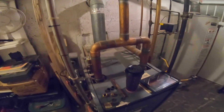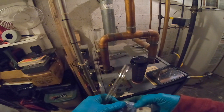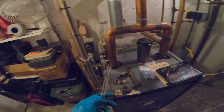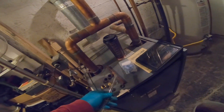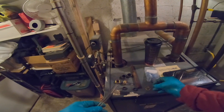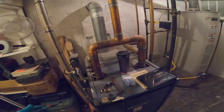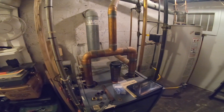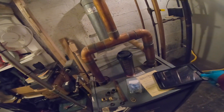What you need for this project is a sight glass and new washers, because without new washers you're not gonna be able to make a seal. Some guys say they reuse the washers — I change the washers every single time. A lot of guys say overkill, no reason for that, and I say do what you want. I've had too many times where boilers leak after I'm done and you're trying to tighten and tighten and nothing is working.